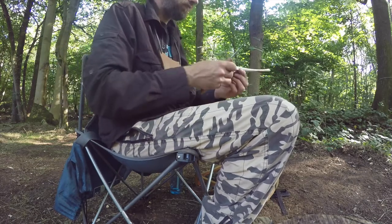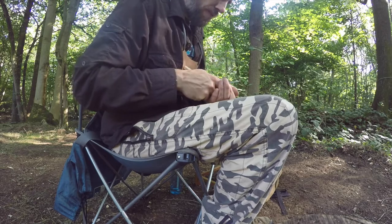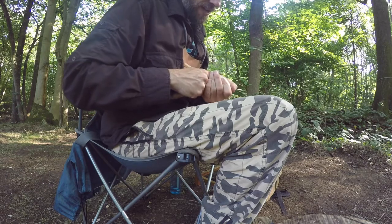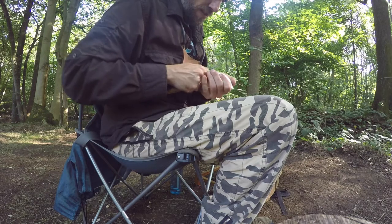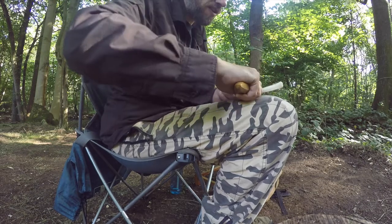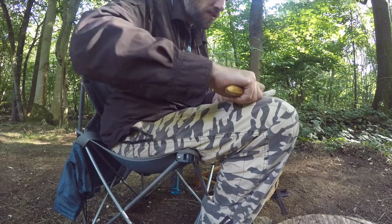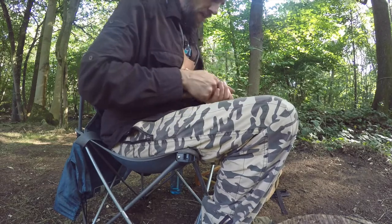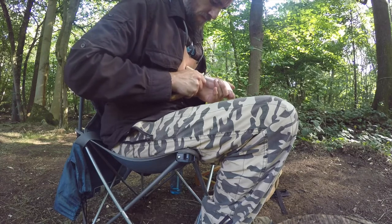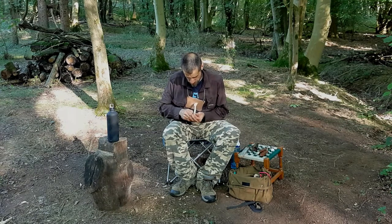Let's see how that fares. Now I can't remember exactly which way around the grain was working on this, so I'm going to have to re-establish that. But you can maybe hear the difference if the camera's picking that up — it sounds totally different. It's leaving a nice glassy smooth finish. I'm going to try and maintain these nice long facets, but just start to refine the cuts that we've already made. I'm going to look to follow the exact facets I had before, then start softening the edges of those, keeping everything in line to start with.